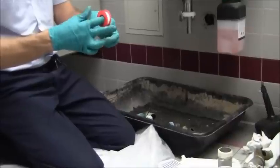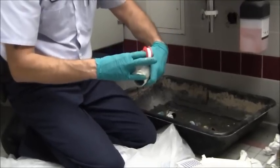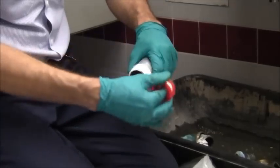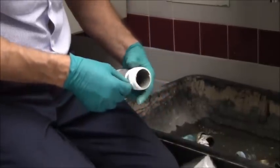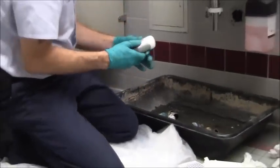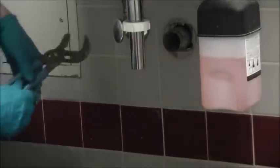Flat, and make sure you put it on the correct way so when you tighten it, it tightens, not unravels. The way I do that is just by holding this piece facing towards my right and wrapping it around this way. That way I know I'm doing it the right way, and I do it the same way every time. So I'm breaking it this way towards me, and then as I screw it, it tightens in. So I'm going to go ahead and put that in. All right. And I'm going to tighten that with my channel locks, just like I did last time.